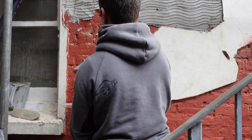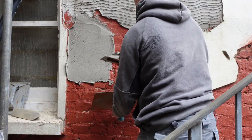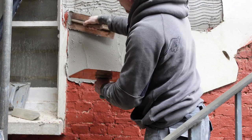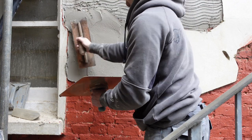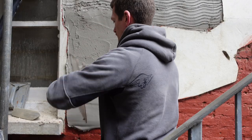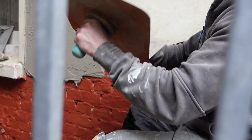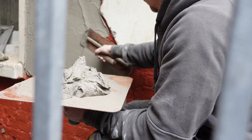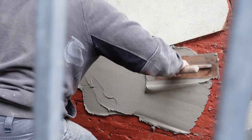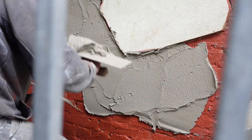The other way I'm going to be doing it in this video is to layer it in two sections. There was just too much patching — we're literally talking about four stories of a building here, which we'll get into in a bit as to why we're patching rather than just taking it all back. It's literally four stories of patching and it's gruelling. So I've treated it like a standard scratch coat. With OCR you can do it in two layers over a series of days — just treat it like you would standard sand cement. So basically just treating it as a scratch coat and then coming back to do sections as we go.